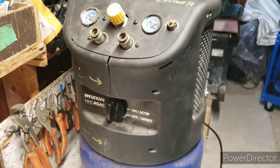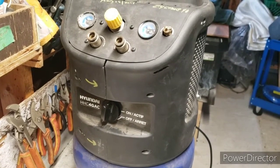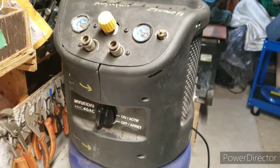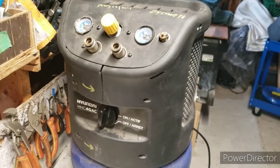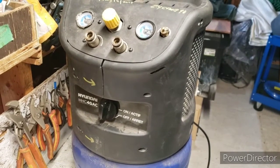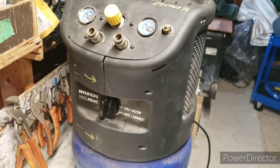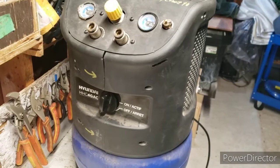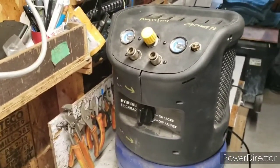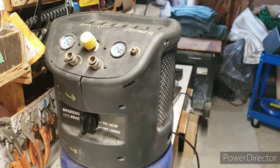So it is a good compressor for what I just described. If you're looking to run spray guns heavily, you're not going to be happy. I do use a spray gun occasionally for touching up tools, repainting small things, or a bit of furniture — that's fine. But if you've got a quarter panel to do or any real paint work, you need a bigger compressor. Spray guns are low PSI but very high volume.